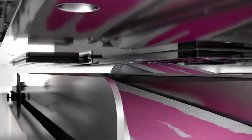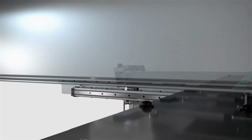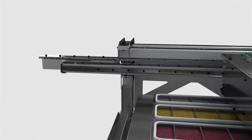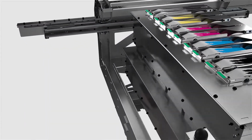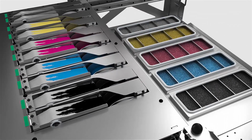The print heads purge ink through each nozzle by applying air pressure. This takes place with the print heads positioned over the capping unit, which collects the purged ink. This procedure removes any air bubbles and pollution inside the nozzles, and brings all nozzles back to a healthy state. Now, to remove the remaining ink from the nozzle plate, a wet wipe is applied, and the print heads are automatically cleaned with a moist tissue material to remove any dried residue around the edges of the nozzles, which could not be removed by the purge and the dry wipe.